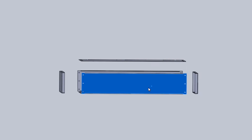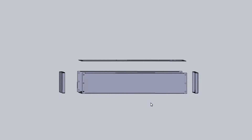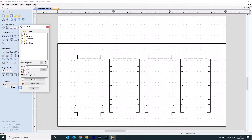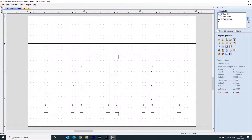Enclosure core components were designed using popular computer-aided design software. We made a virtual assembly and exported components in DXF coordinate files. Necessary cutouts were drawn in CNC router management software, significantly shortening design time. Our router comes with valuable management software that allows quickly drawing 2D elements using construction shapes and snap-to-grid functions for precise dimensioning — the logic is very similar to CorelDRAW vector graphics software. Unique to this software is the integration of drawing and milling tools in one, with automatic G-code generation.